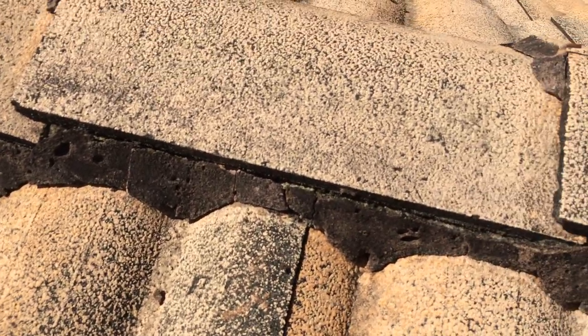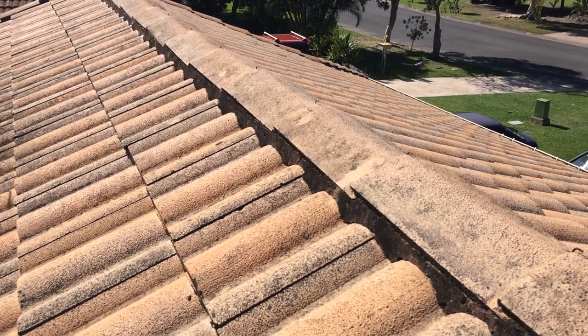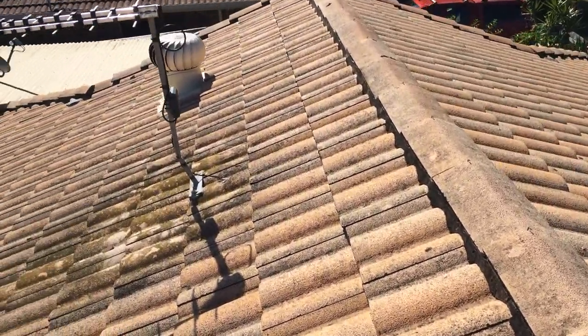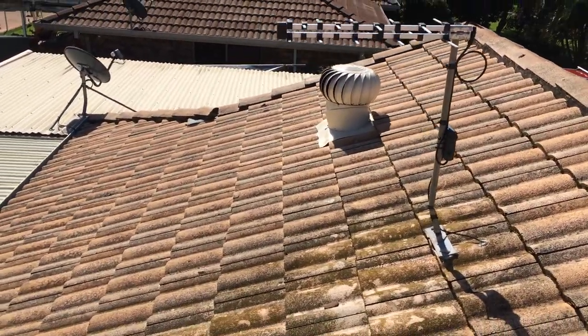That's what all the caps look like — there are 80 caps — and if there's a good bit of rain, there's nothing much stopping the water coming up through under the bedding and into the roof, or the caps from lifting. You can see that's the other roof vent we put in down there.